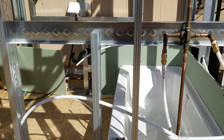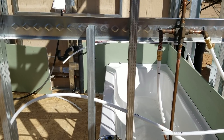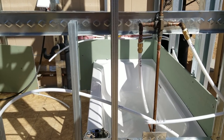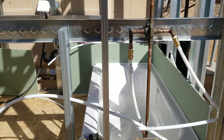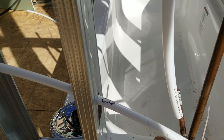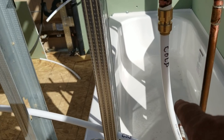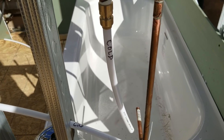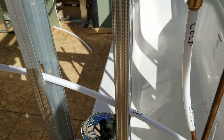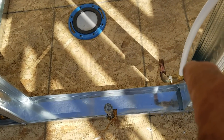Welcome back to Jeep Air Homesteading the Desert, September 8th 2018. I got a little bored today so I started adding some plumbing. I ran my lines over — I didn't have the T's to make the connection. There'll be a T here, these ends will get cut off, and a T goes in. That's the cold water line — I wrote 'cold' on all my lines so later if I ever go inside the wall I'll know if it's hot or cold water. The cold water runs down to the toilet.